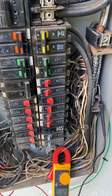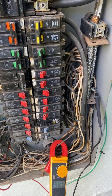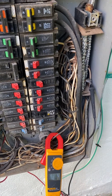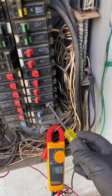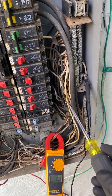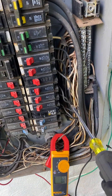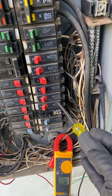The issue here is whenever you turn on one breaker, the other circuit breaker trips. What I've got here is this breaker with this black wire and this black wire feeding the same circuit. I've got two black wires feeding the same circuit, but they're from opposing phases.